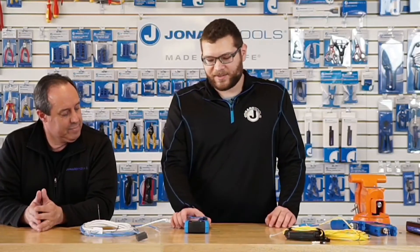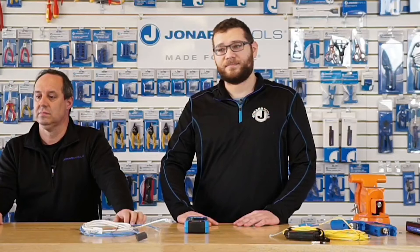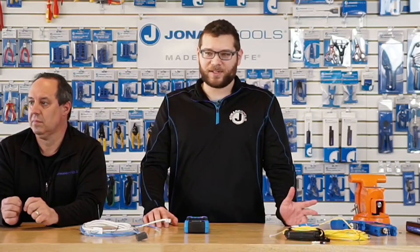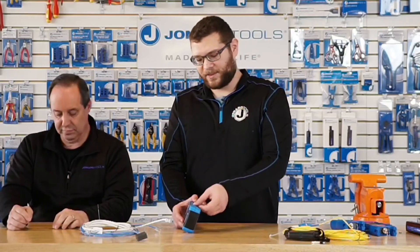What is the average range? The OTDR-1000 can detect fiber from 500 meters to 64 kilometers, so anything in between is fine. Is there internal storage and how much does it hold? The internal storage is 25 megabytes, which might seem small, but it can save up to 750 test results. For additional storage, there is an SD or TF card slot where you can put in a micro SD card for extra storage.